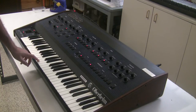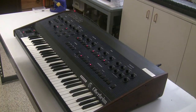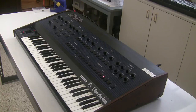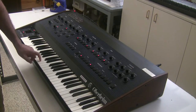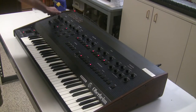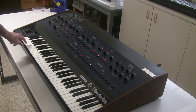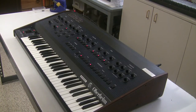Voices three and eight failed, so we have six voices active but they still sound out of tune. This is also very inconsistent — if I hit autotune again, completely different voices may indicate they've failed. Also, as you may have noticed, the keyboard is very noisy and some keys are sticking up, so we need to redo the bushings on this keyboard.